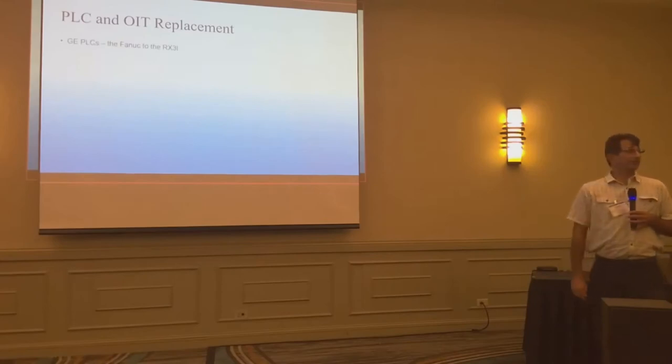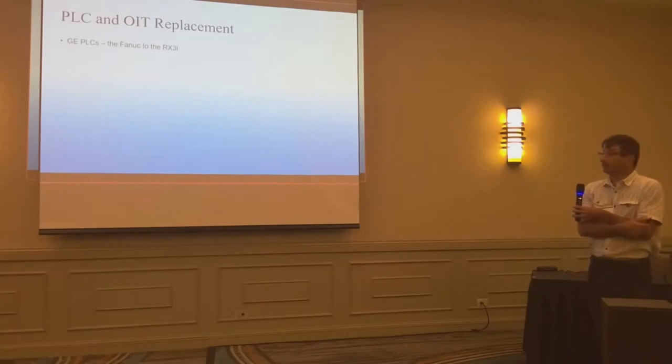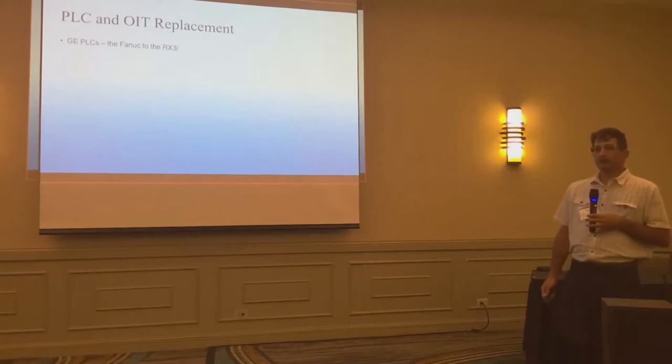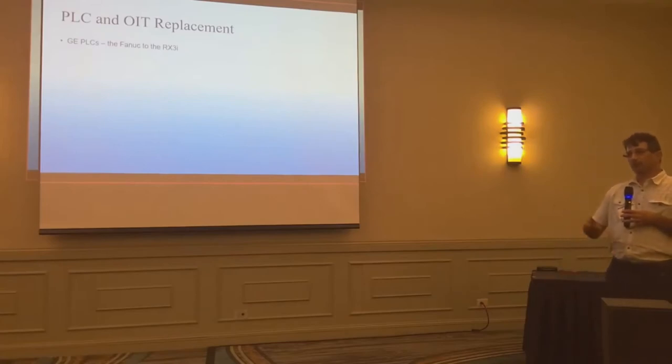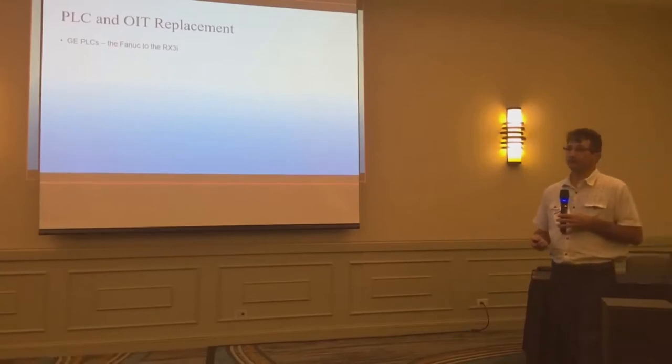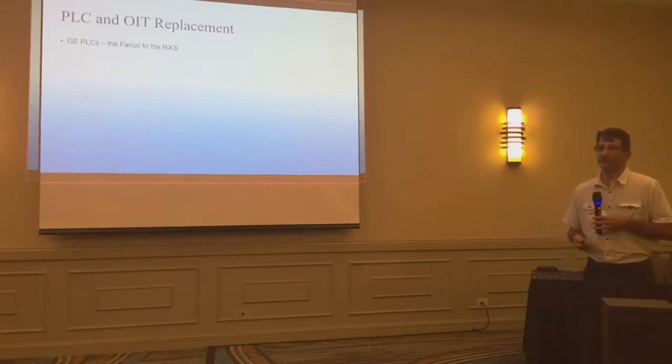Any other simple line questions? On PLC, is there an updated heat on the line control that you recommend, or are you still just using the PID on time control? Yeah, we use a lot of local controllers typically. We do some control with the PLC as well. We like the local because I think it's more robust, is my personal opinion. The contacts on a PLC would definitely fail after some time. We can have some problems with the digital or solid state outputs on PLCs. Yes.